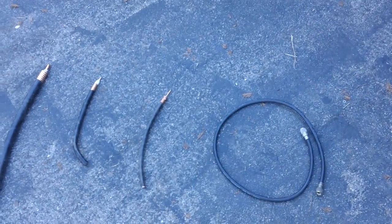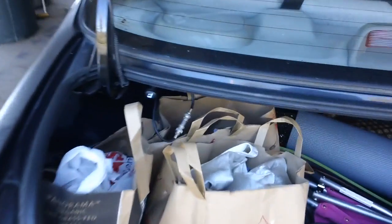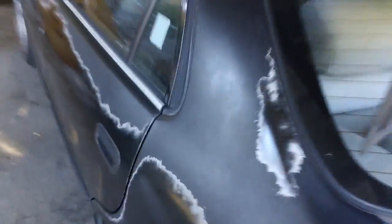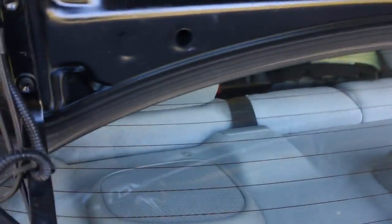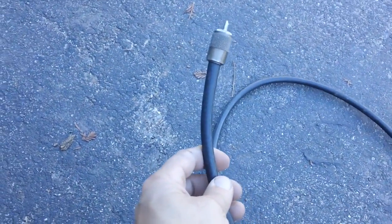Here's an example of the types of cables out there, from extremely crappy to extremely good. A lot of hams and civilian guys are mostly used to seeing this RG58 — that's the thinner cable. This type of cable is pretty much good for field expedience, like running an antenna onto your carport or something like that, and it's also used for vehicle installations. Here I've got my whip antenna running in the vehicle with this cable — it's good for that because of the size.